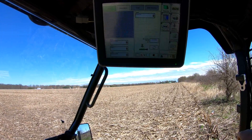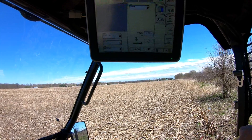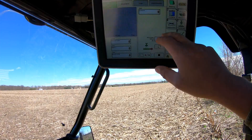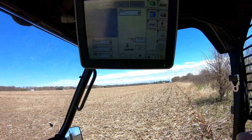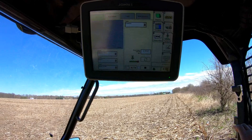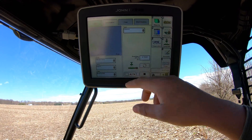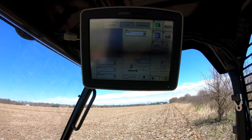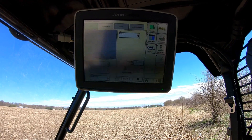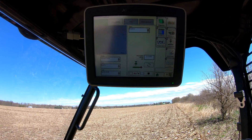Like I said, a ditch would be non-passable obviously, or a lane would be passable. You can map those if you want. I've been doing those only if they're really interior boundaries — otherwise if they're on the outside of the field, there's really no reason to boundary map those at all. The boundary offset is already inputting the offset automatically. I'm going to change that because the Gator is five feet wide. The AMS guy recommended putting an implement width of the same width as the Gator, so I have a five-foot width for the implement. It's just taking the offset of the implement width and splitting it in half, so it's two and a half feet.